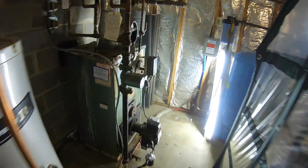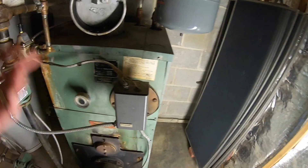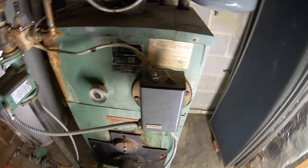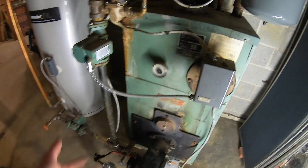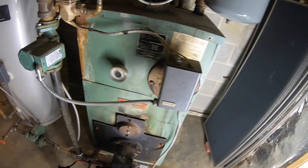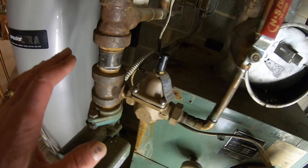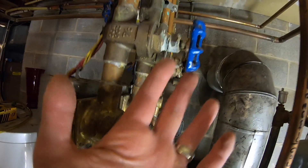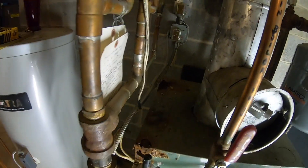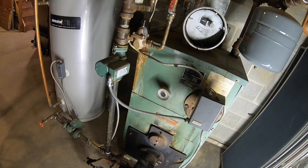I didn't go out and buy a $200 Aquastat — if this thing breaks I'll just buy another one at Home Depot. But in this particular case, the thing was tripping out on safety two, three, four times within a 24-hour period. Pardon how disgusting this looks — it looked like this when we moved into the house. The prior owner didn't know you just tighten these packing nuts and it stops a drip. So these things must have been dripping for a year to get rusty like this. Doesn't affect their performance though.